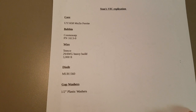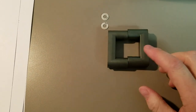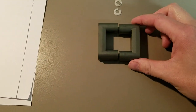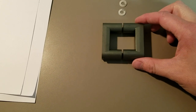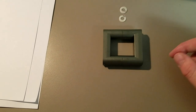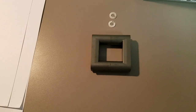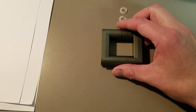Here's my little parts list. The core is a UY1658. Obviously you need two pairs of these — one for the primary and secondary, one for the chokes. And they can be separate; they still work the same way. One problem with this is because of the material it's made out of and the size, it has a really high AL value. That basically means if you wind the same number of turns that Stan had and put them on this core, you're going to have an inductance probably five or six times higher than you're supposed to. Because of that you're going to have to gap it — introduce a gap in the core. I'll explain how to do that in a minute.